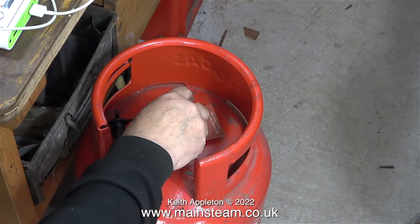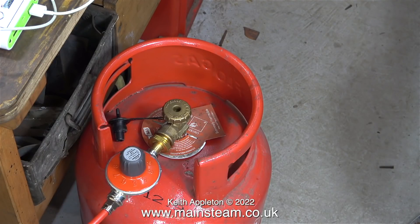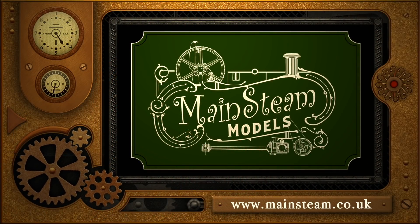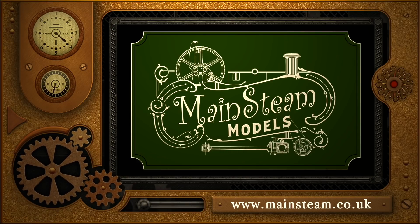That's it for the test — the final step is to close the valve on the canister. I move the boiler and the canister into a position in the workshop where it can stay, and when I want to use it as a workshop test boiler all I have to do is connect a suitable water supply and then light the gas using an open-flame lighter. I can recommend having a Castle V6 boiler in your life — they really are very good. Stay healthy, do not set fire to yourself, thanks for watching, and I hope you found it useful. Please visit my Mainsteam Models website and click on the video playlists section to find other videos you may like to watch.